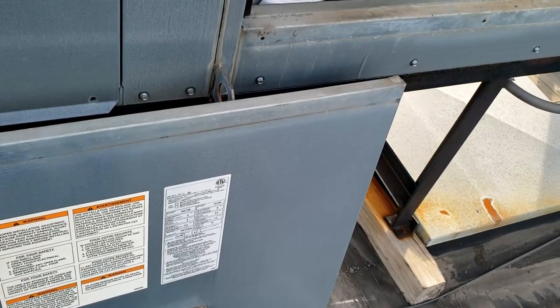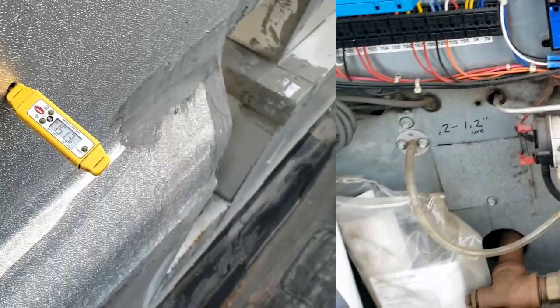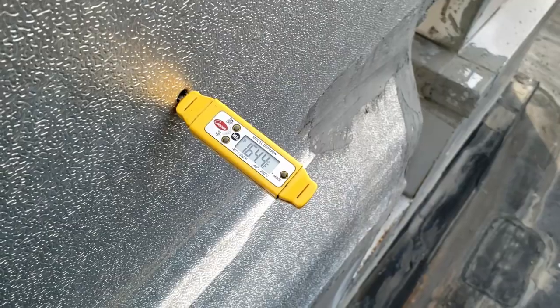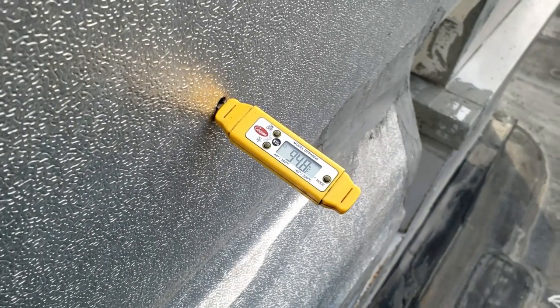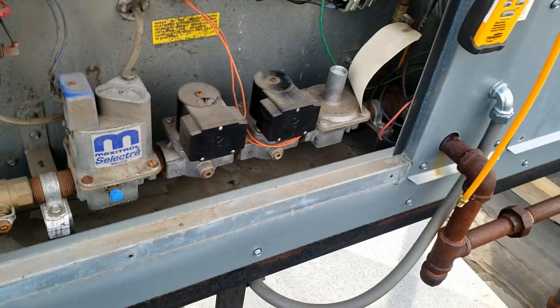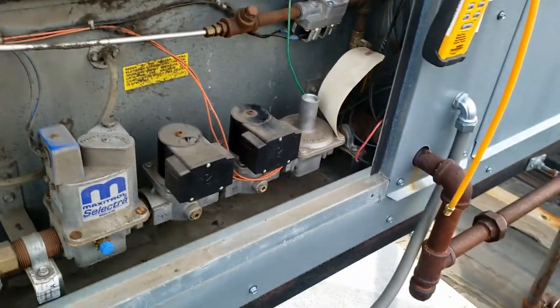We can put it into maximum fire to see the absolute maximum rise. That's way overshooting — coming out at 170-something degrees, so something is definitely out of whack. Looking at the main burner — yeah, that's not set up right. At 176 degrees it's going to trip the high limit. After making adjustments on the regulator: 23 plus 72 comes out to about 95 degrees and we've got it right in there. We just had to adjust the regulator — that fixed the high fire rate. The minimum is also fixed.